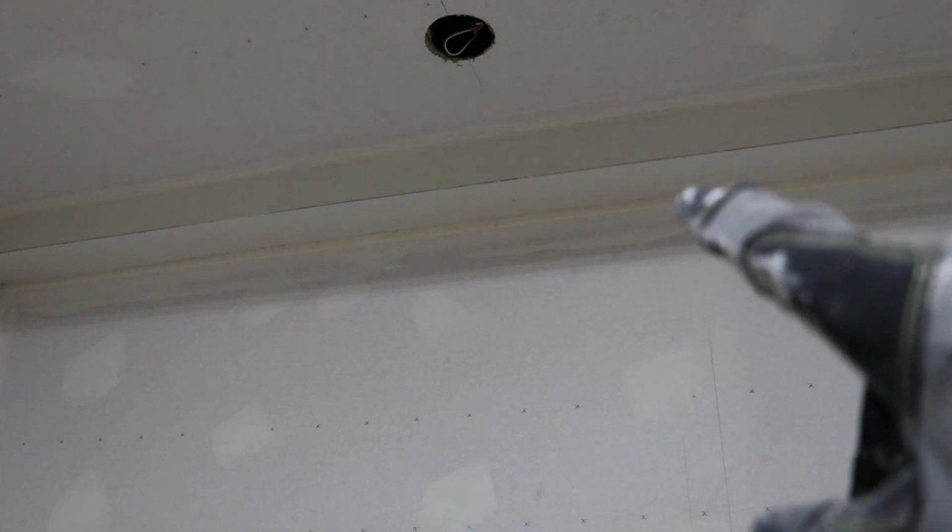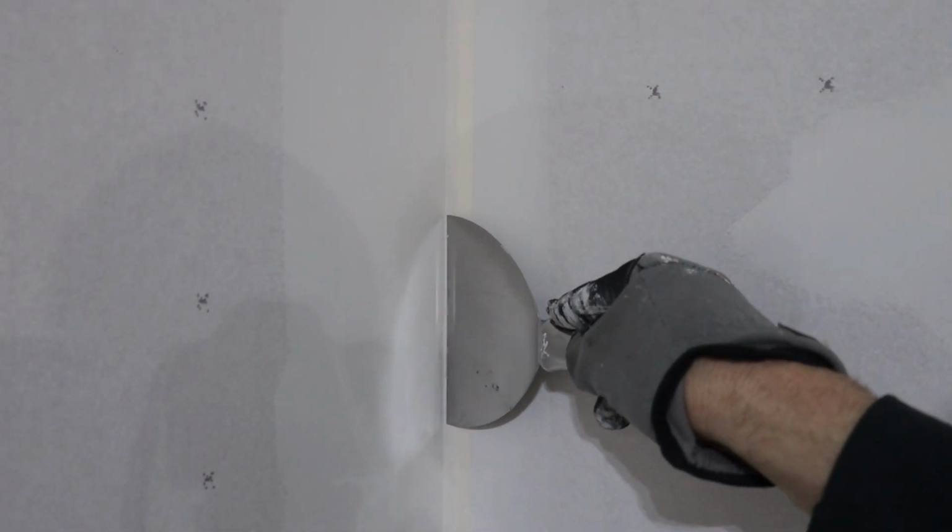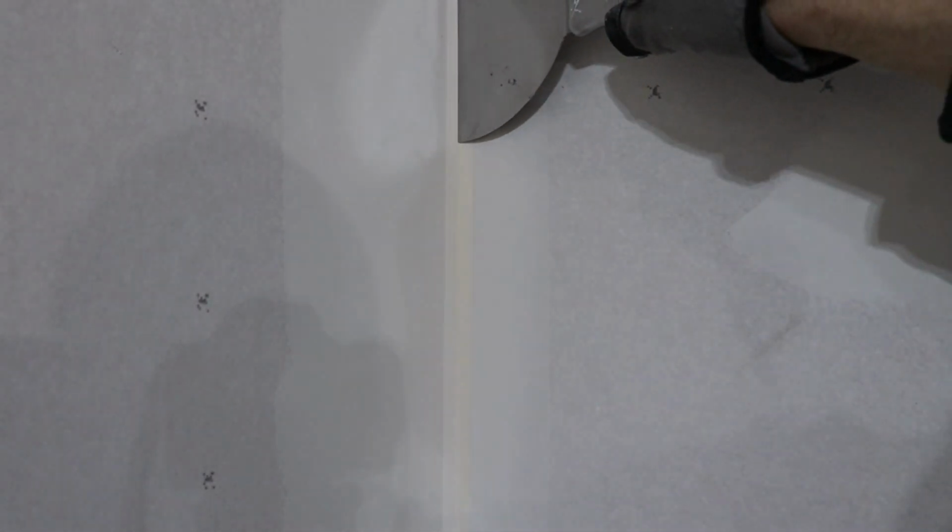This outside corner here at the top is going to be finished just like that wall that I showed you. Of course, it only has 2 sides instead of 3. And in this inside corner, before you coat the other side, there might be a little bit of drywall mud in here. You don't have to get all of it, but anything that's going to make the drywall mud not flat, and maybe make it bulge out a little bit in a few spots, just go ahead and knock that off.